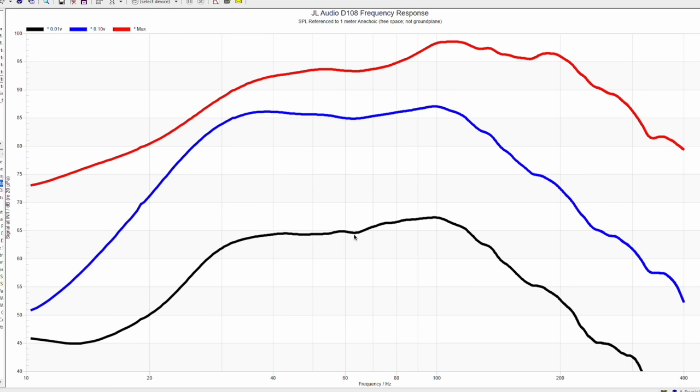It's going to free up your bookshelf speakers and provide more detail and more dynamic range. Let's take a look at the data. These are anechoic measurements at one meter — I was targeting about 65 dB in the black line, and you can see the extension F3. JL specs it at about -3 dB of 29 Hz, and I think that's probably pretty reasonable depending on where you draw the average. As you increase the output to about 85–87 dB, that F3 point still remains about the same.